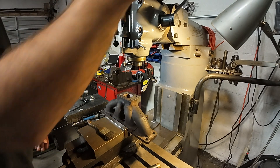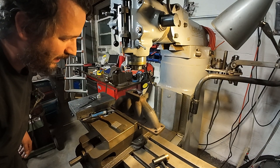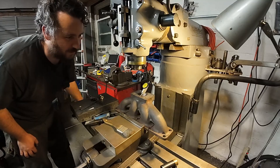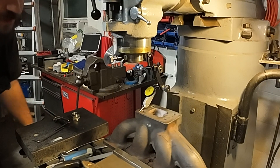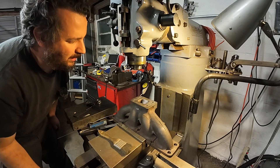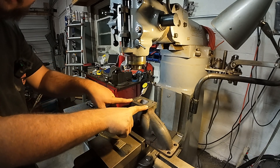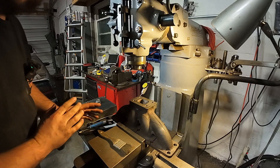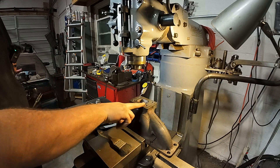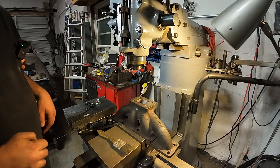We're not going to assume that this flange is parallel, so we will give it a sweep and see how close we are. This will tell us how much we're gonna be taking off anyway. She's five thousandths high in the front here, going even higher coming back — so there is actually some flatness issue along here. She's pretty good there. So I'm zero pointed here and here, five thousandths high here, and about three thousandths high here. In order to take the minimum off to get it straight, I want to bump this up two or three thousandths to make a straight line. You're still going to have a bit of a rainbow or banana in the middle here, and then this will kind of shake out.